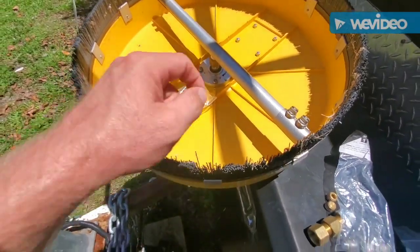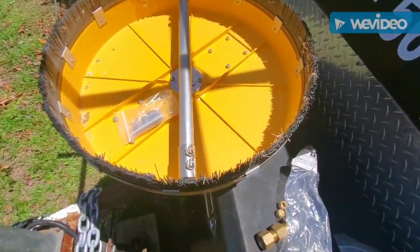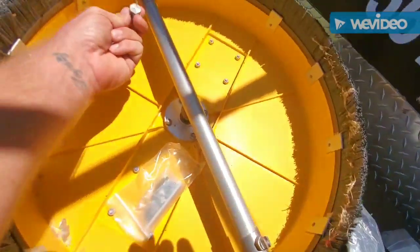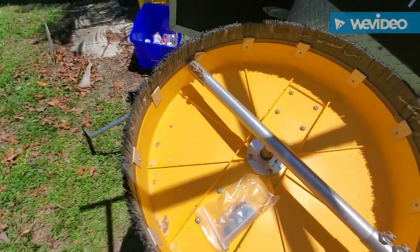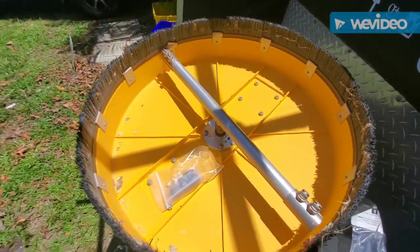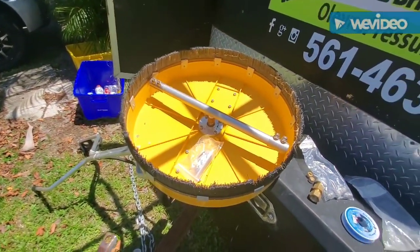That's ideal — you have to move a little slow with the 19-inch but it still gets the job done pretty good. Anyone that's ever used two 2502 tips in a 19-inch surface cleaner will tell you it's really not that bad. If you have the intention of upgrading, all you have to do is remove the plugs and put in four 2502s, 2505s, or 2503s. So instead of getting a 16-inch Whisper Wash for your four gallon per minute machine, when you upgrade to an eight you'll have a surface cleaner compatible with both machines.